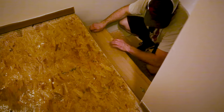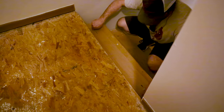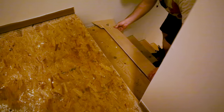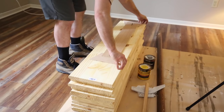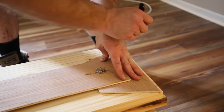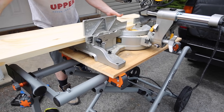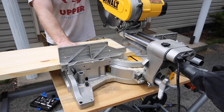So my sweetie made a really cool stair jig-a-ma-bobber, and he was able to measure the exact dimensions and shape of each space for the treads and risers. And then he measured each tread and riser and cut them to size and numbered them according to which step they would fit on. It was actually a really neat idea. We saw some of these online, but they were really expensive, so he just made one himself. And we cut them to size prior to staining so that we didn't use any stain that we didn't need.